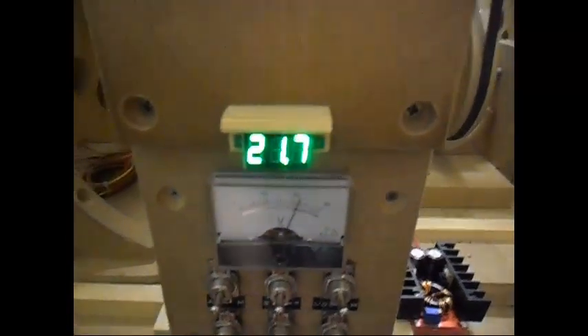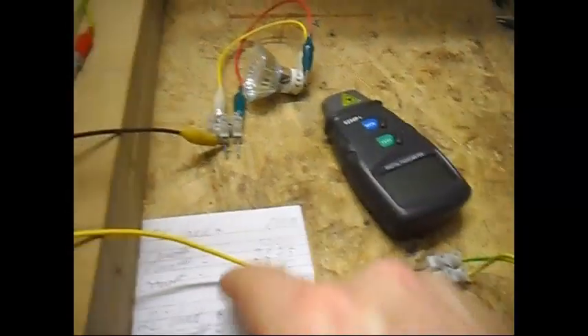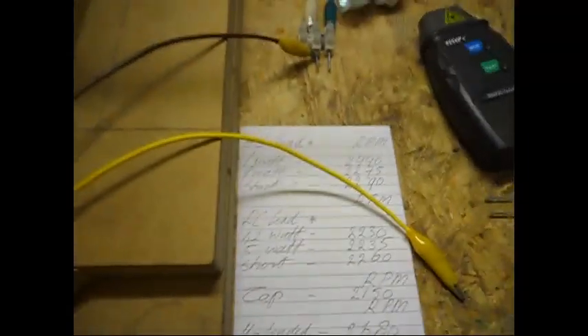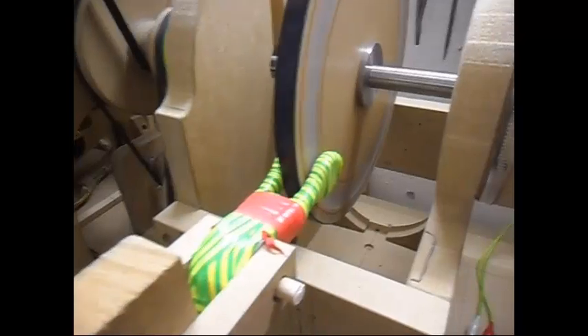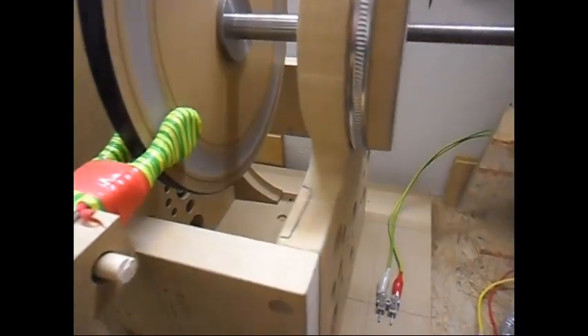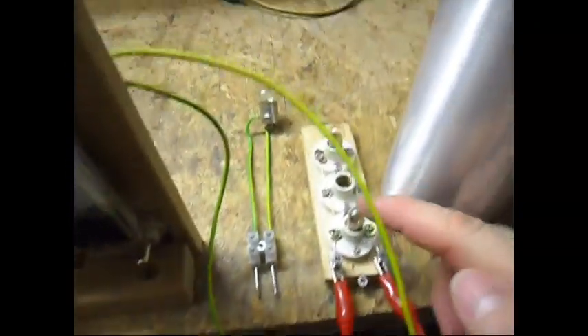Going for first speed. I'm going to do a 1 watt AC test, a 9 watt AC test — these 9 LEDs all in parallel — and also a RPM test. I've written down all the RPM test and load results because the disc coil does put some drag on the system on the drive side, but it does it very slowly, so it takes minutes between tests to see the stable RPM. Then I'm going to do a DC load test with a 1.2 watt load, a 5 watt load, and of course fill this large capacitor.